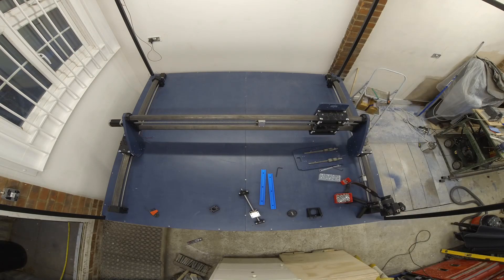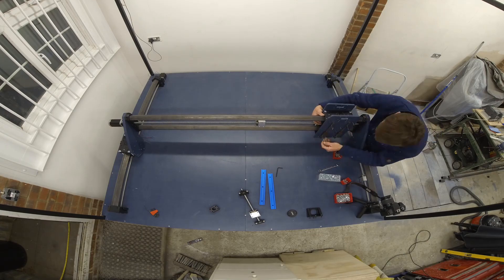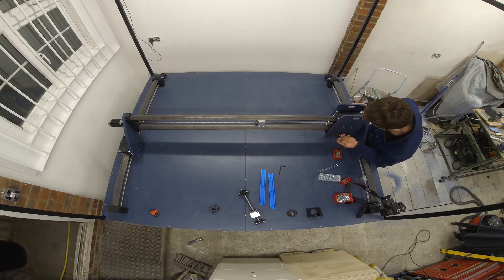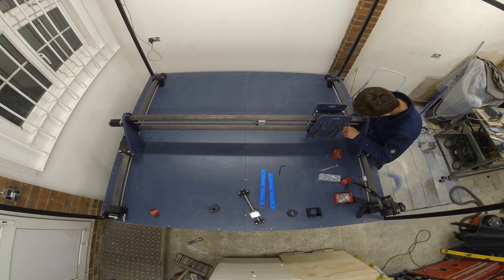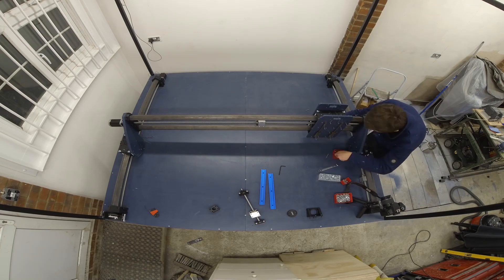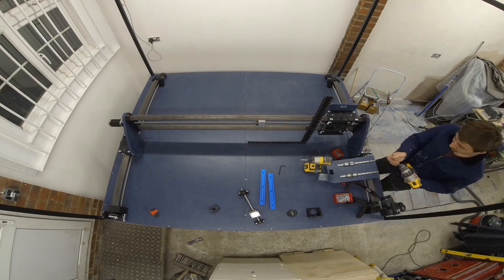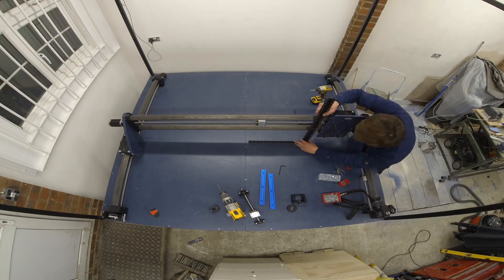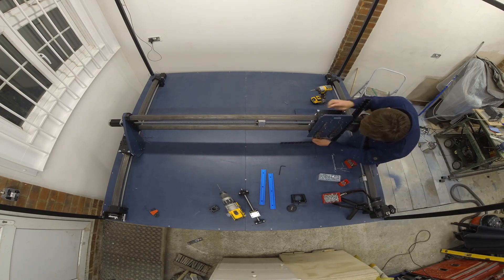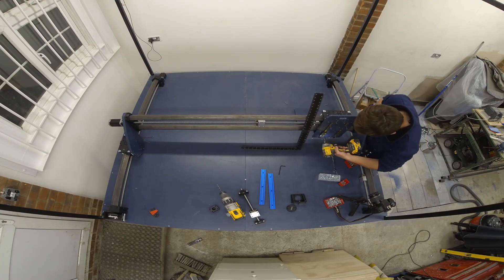Mounting the front and rear z-axis plates — the carriages can be tricky as the underside nuts tend to fall out, but with a bit of patience you'll get all of these in. The fixings for the z-axis carriages were M4 countersunk screws. These were just screwed into the panels without pre-countersinking the holes; the torque of the screws alone is enough to deform the wood and leave a flush finish once tightened down. Unfortunately, due to the design, you can only use countersunk M4 screws here, as a pan head or hex head will protrude and stop the z-axis carriage from moving — please ensure you do use countersunk screws.